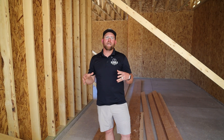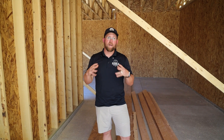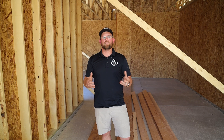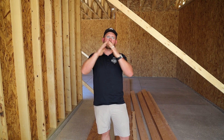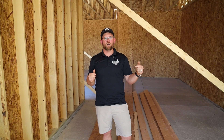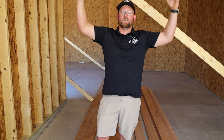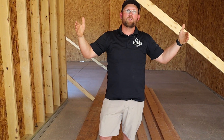We're currently in the garage. Any of you who have had kids know that magnet tiles allow you to build some cool structures, but the structural integrity isn't great. With maybe two walls and a roof, it doesn't take much lateral force to knock that tower over. The same is true with a building — we want to ensure loads above us come straight down through the wall section to our stem wall and footings.